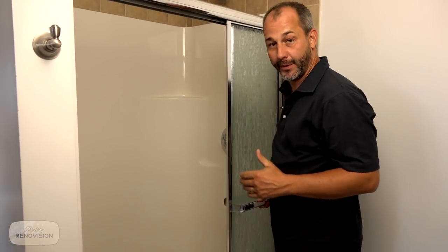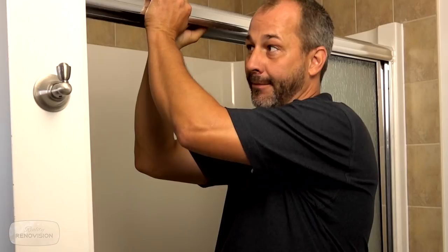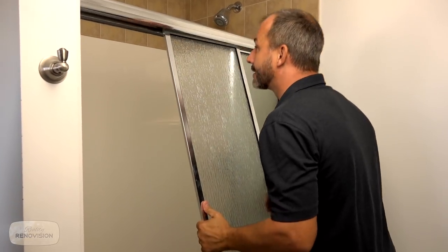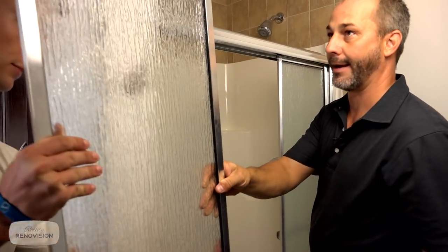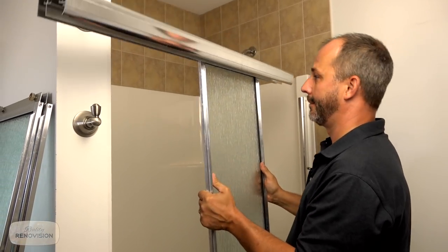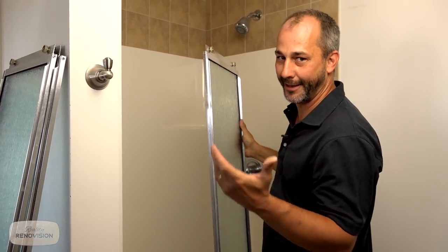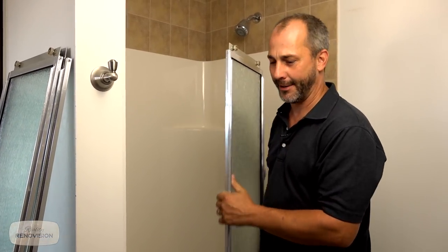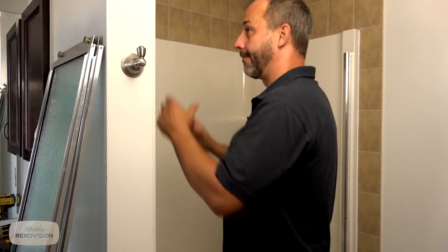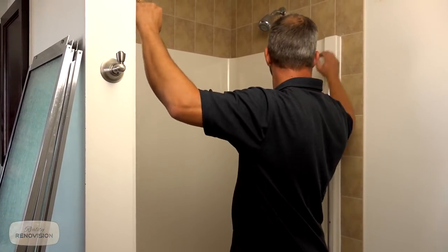A quick tip when you're removing one of these door systems: you need to understand how it was installed and be really careful so you don't have an accident. Basically this is like a closet door — the wheels are just hanging on the top track. And this is the dangerous part: it can all come off together. In a lot of cases the top rails should be siliconed in place so it's a little safer. Can you imagine just having a shower one day — if you're a tall person and you lose your step, you hit that, the doors go flying everywhere. That'd be horrible.